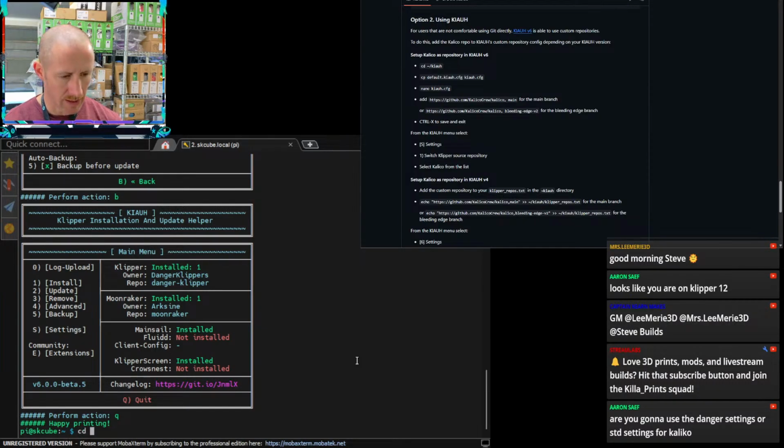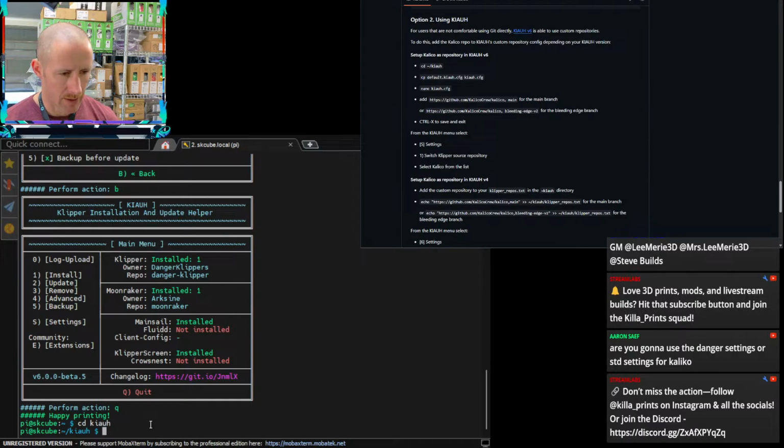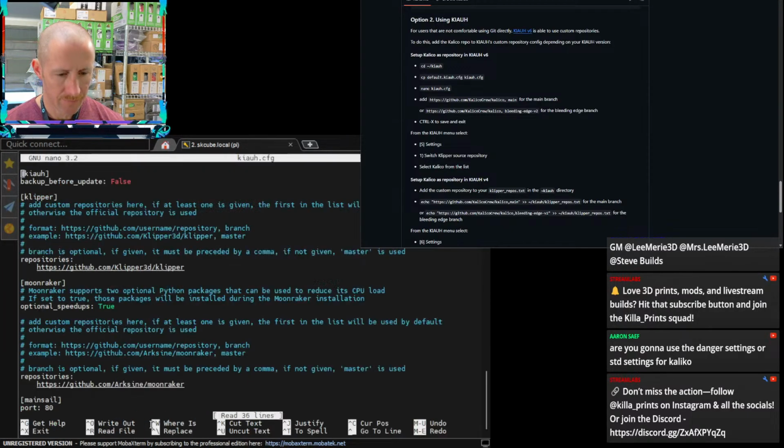All right, so cd to Kiauh. Oh no, where'd it go? Trying to figure out how to type the tilde on my keyboard here. Let's see if this does it. All right, so we're there, and then we do cp default Kiauh config. So we just copy that one over, and then we're going to do an edit on this config.